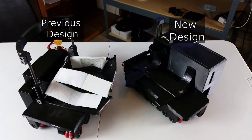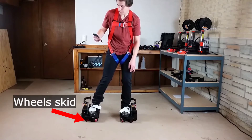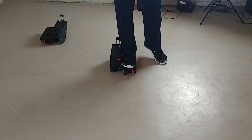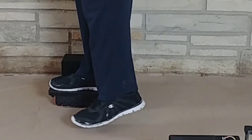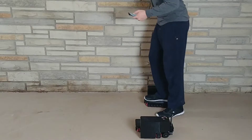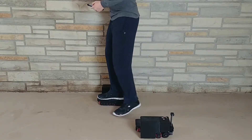In the last video I shared a bunch of improvements I made to my omnidirectional VR shoes and I went to test them out and they did not work as well as I expected. The skidding problems that I was having in the previous designs were worse with this design. In this clip you can see that the wheels are spinning but they're not catching the floor — they're not moving me back — and then I lean a certain way and it works. It moves me back, and then it starts having problems again.